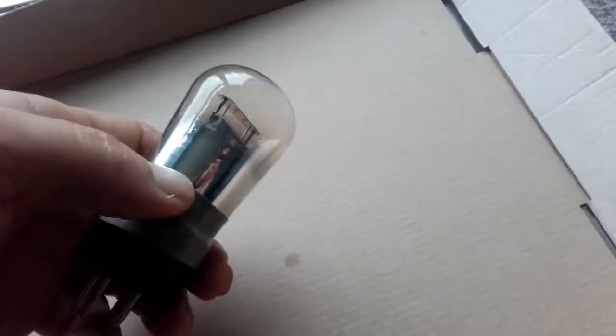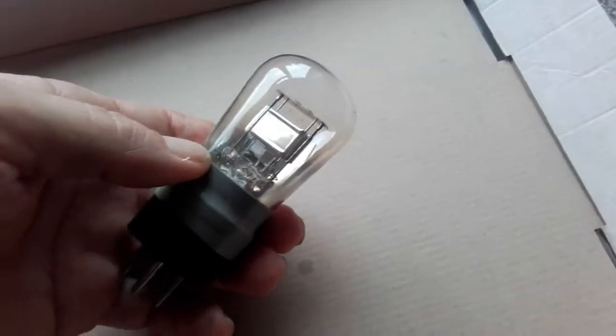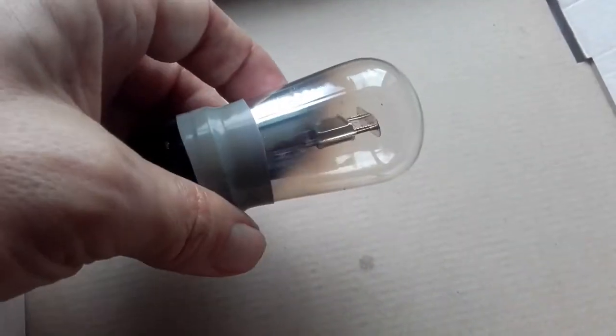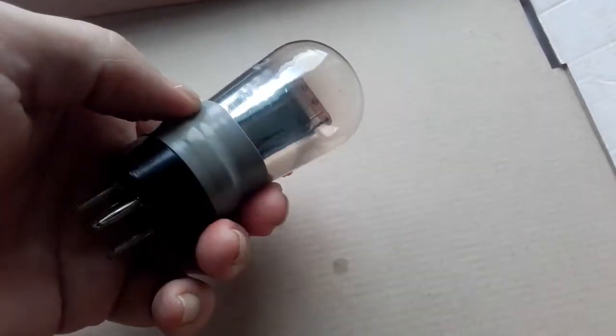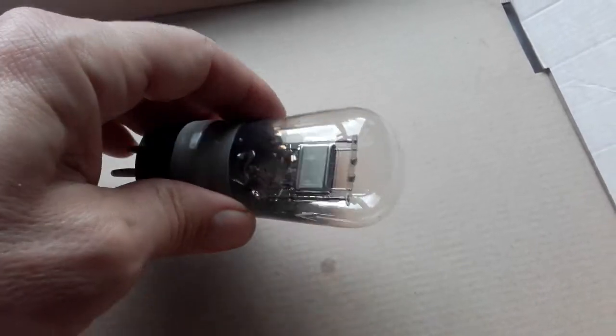If you were very very lucky you might have had a crashed airman in the camp who, before his plane caught fire and exploded on the ground, managed to get into his spares box and grab a few of these. These are radio valves specifically made for the RAF, and they work on two volts, which is really really good for what we're going to try and do.